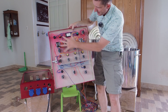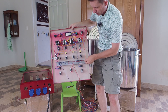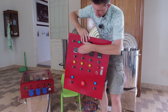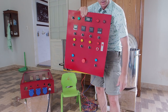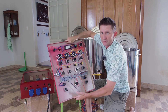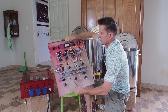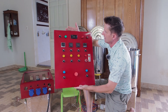That's what I've been doing - let's look at the reverse of the panel. It's not finished yet but the main components are wired. Some of the switch components and lamps still need wiring, and once the door is connected I'll fit the wires into the trunking and seal it up. Then I'll test everything to make sure it's working. As it stands, the PIDs, lights, switches, and the emergency stop button are working - if there's any problem I can hit that quickly and power to everything will cut out.